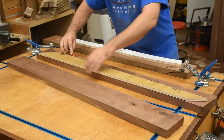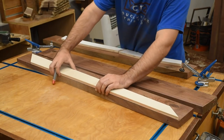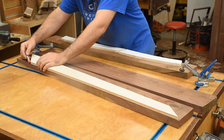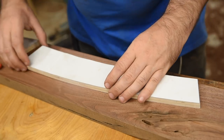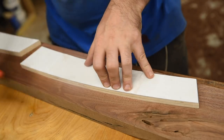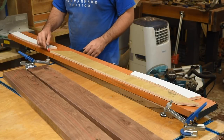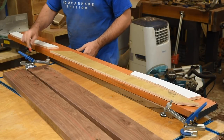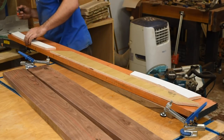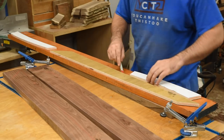Now I can mark out each of my leg pieces. I take care to avoid any defects and also pick where the grain matches the flow of the piece. So the pieces that are curved, I try to lay out with curving grain — they'll be a bit stronger this way, but mostly it's just going to look better. For the orange heart, the layout is all about maximizing material. It's pretty expensive, so I'm jigsawing the pieces out of the board and there's not a whole lot of margin for error.